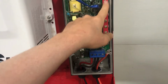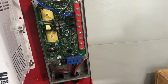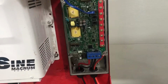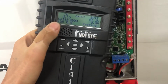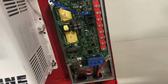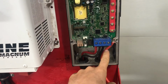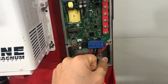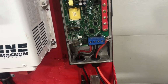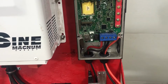And it turns out, I think, doing some research on the subject, that I have shorted out some of the power MOSFETs here. And I don't know why that happened. My array voltage is low, but it's showing 0 volts on the input, and I've got about 225 volts on the input here. And if you put it in there, it's a dead short, I believe, through one of these MOSFETs or 2 of these MOSFETs here from my research.